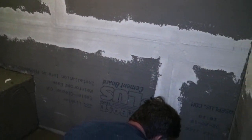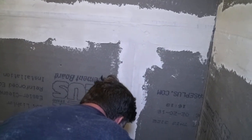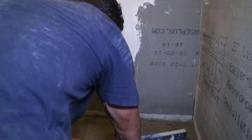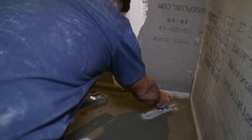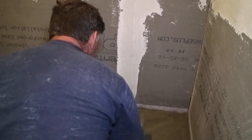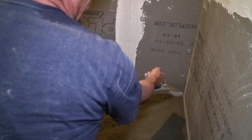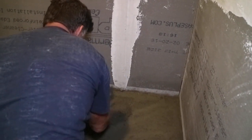I'm pulling a little bit of this mud. It's always a little challenging — every one you do really takes some patience. You want it to be very, very flat. You want the right amount of pitch. We usually put about a quarter inch per linear foot. If that's three feet, I should have three quarters of fall from there to there. That way the water will run off really well.